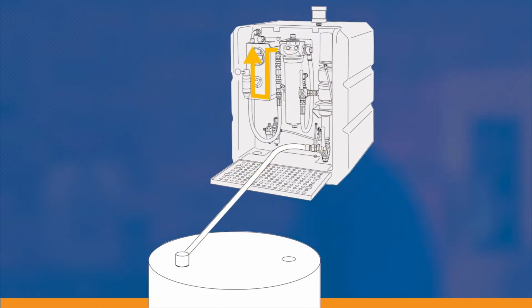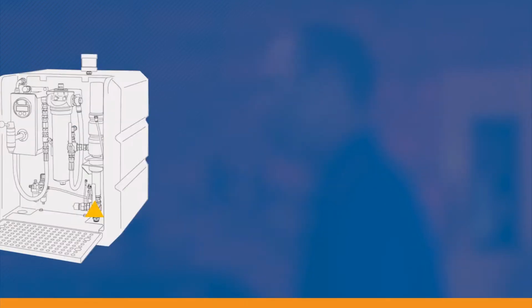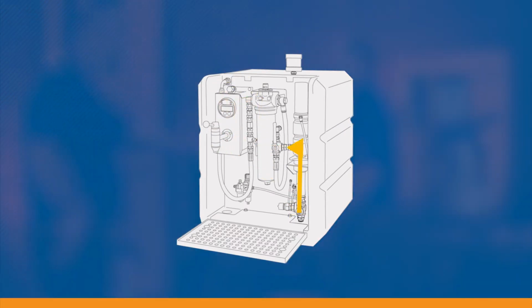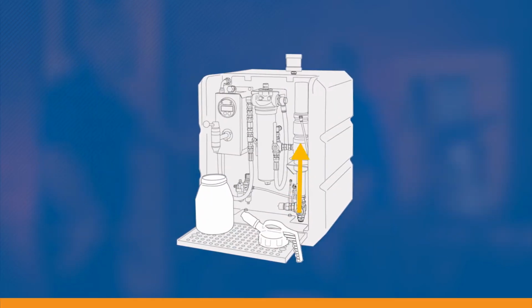As we know, incoming lubricants aren't always clean. So cleaning that lubricant before we put it in the tank, huge, right? Sure. Once it's in the tank, if the lubricant's set too long, maybe the additives settled down, let's stir those up, agitate those a little bit, so we could do that. And then if we want to take lubricant to a machine, we can filter out of the unit into the sealable and refillable container to take it out.